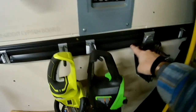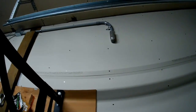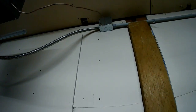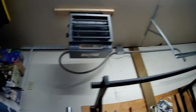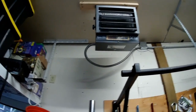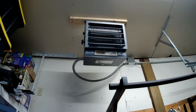I brought the wiring down through the wall and behind it to protect it from my workout equipment. I ran it through the studs up to the heater location, then used schedule 40 conduit over to a junction box on the wall. After that I ran flexible conduit from the junction box over to the actual heater — the heater does not come with flexible conduit. I bought about 25 feet for $20 at my local Ace Hardware and only used three to four feet of it.